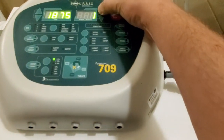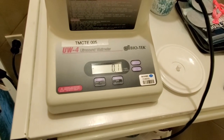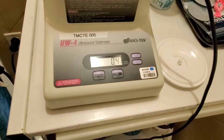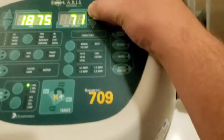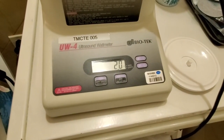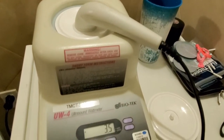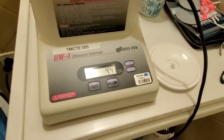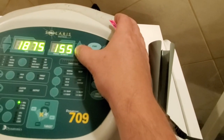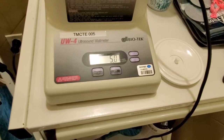We hit the start button, and then we press that button. What we should see is the meter starting to climb. What we have to do is take it up to five watts, and when it gets to five watts that's when I'll stop. You can see this is quite the process — it takes a while. I've got the button pressed and I'm holding it down: 1.8, 1.9, 2.0. Now the five watts is in your manual and that's related to the five centimeter head. If you have a two centimeter head, then that's going to go to two watts. You got to go kind of slow because the watt meter takes a minute to catch up.